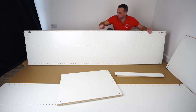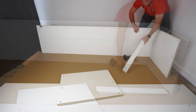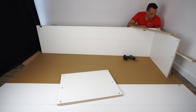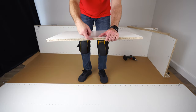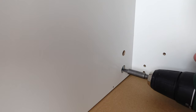Now we can lift this panel up. The back of the wardrobe is on top. Join them together with the bottom panel. Secure the locks by twisting them to the right side. This is the bottom panel of the wardrobe. We're going to go with the front slim panel — the colored side facing the front. Slide it in under the legs and into the first two holes, just push it in. Now do the top panel. All the gaps are going to be on the inner side all around the wardrobe so you can place the back panel in comfortably later on. Slide it in, and if the locks are in the right position you won't have any problem securing them by twisting to the right.